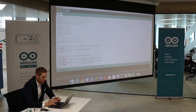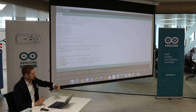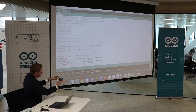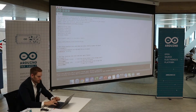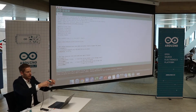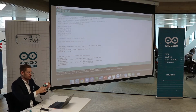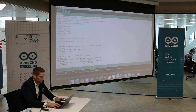So now we're going to check if the code is correct — that's fine. I'm using the USB cable connected to my board. I already built the circuit as seen on the screen, so I'm just connecting the board to it. I'm going to upload the code — and there you go, your LED is blinking! It's very easy. And for example, if you say it's too slow and you want to make it blink faster, just reduce the delay time — for example, go to 200.